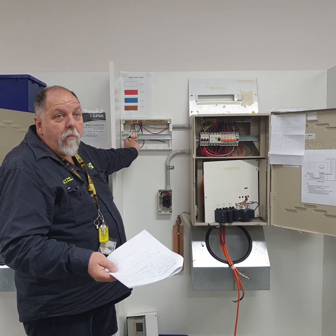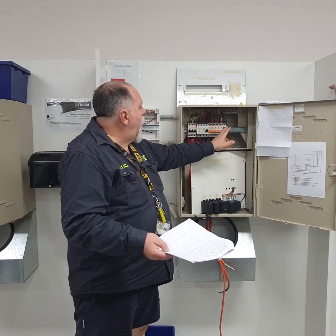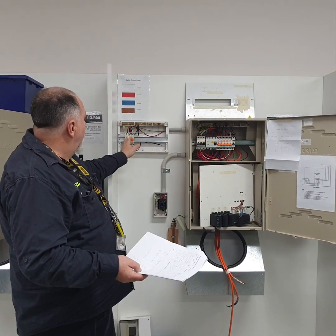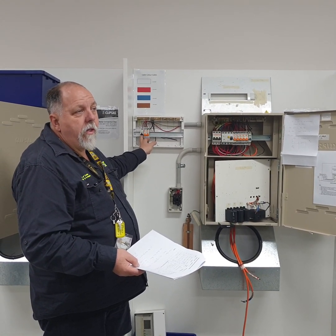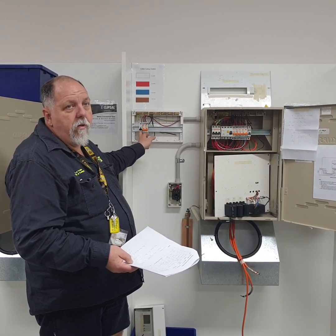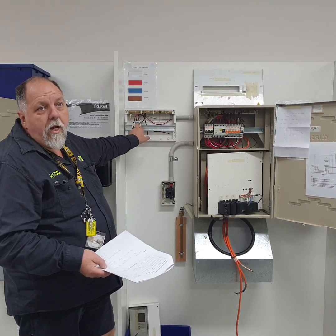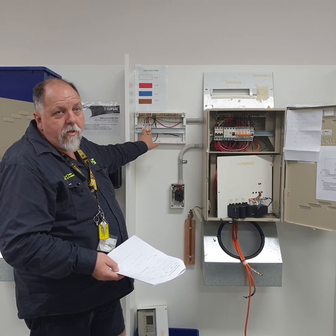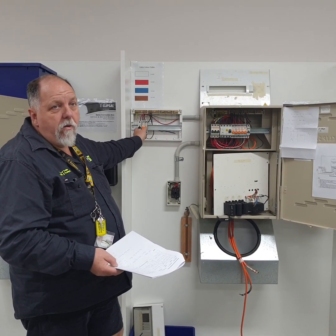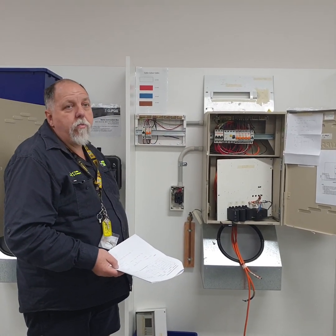And it's pretty hard really to buy an isolator these days. So we'll put in a circuit breaker, so it's pretty much double protected. I can't put a 16 there. I could put a 32 there, but it's not appropriately protecting the cable. Do you understand what I'm getting at? All right. These two here combined came to 13 amps we looked at, all right, which was our maximum demand. Our circuit breaker, or the main switch coming in on that there, cannot be less than the 2 maximum demand combined on this board.